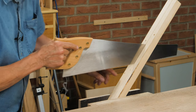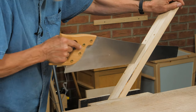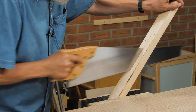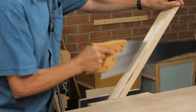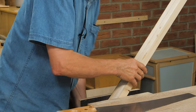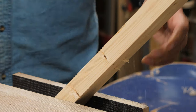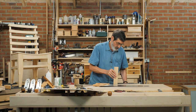Here I'm going into the line — I'm actually on the line — so I've got to go back up here, bring this back down, now I'm on the right side of the line again. Keep turning it around so you get to the other end of the stick of wood and you will have a reasonably parallel piece of wood. That's what we want.